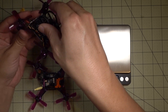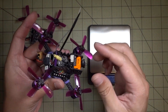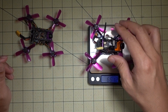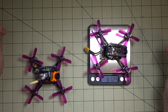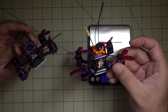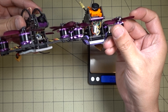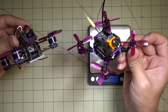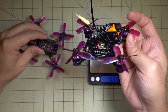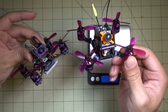Let's compare the weight. The unmodified Lizard versus the Dinosaur with the micro-swift installed, soft mounting done, and original camera removed. The Dinosaur comes in at 66.1 grams; the original Lizard at 67.3 grams — so it's about a gram lighter for the modified Dinosaur. I think the weight savings come from the thinner base plate — less carbon, less strength, but less weight. I also removed the carbon protective pieces for the circular polarized antenna, which helps offset the weight of the micro-swift upgrade.